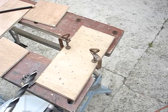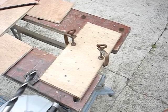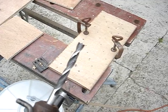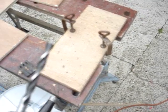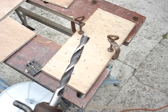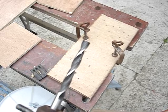I've put two G-clamps in place to hold both the back and the front together. I'll drill with a 9mm drill bit across so that the 9mm will hold the wooden dowelling at the back, and it will create the entrance. Then later I'll widen the entrance to hold the outer limits of the tube. I hope that will all be explained.